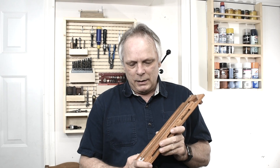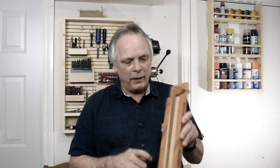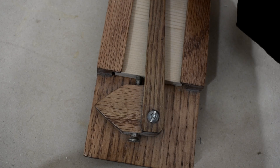What I have here is a moisture meter, and I usually have it hanging behind me. I thought I'd show you guys how to make one. How it works is this piece is a cross-grain piece of spruce, so the strip of wood is free-floating and not restricted in any way, so it can expand and contract with the humidity changes in the shop, therefore moving this pointer.